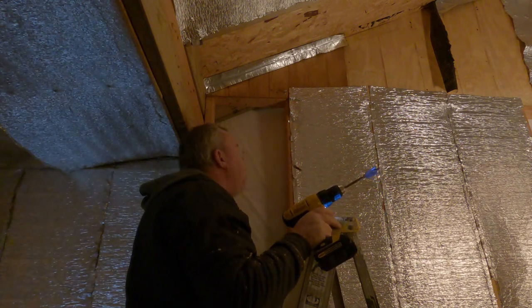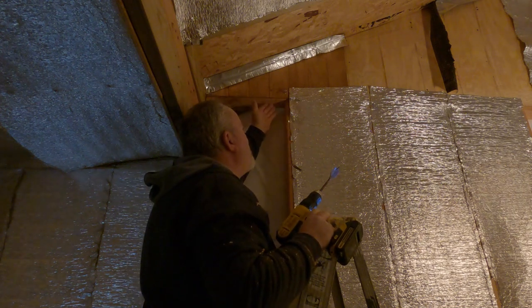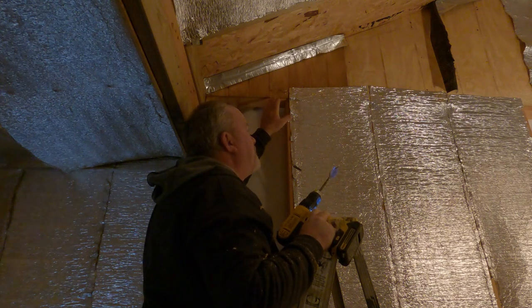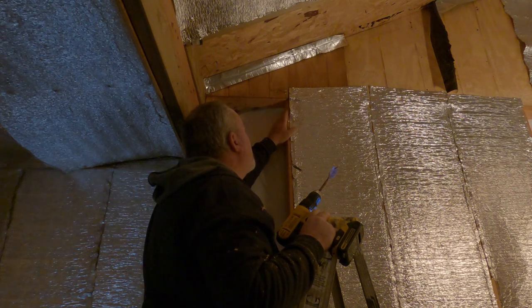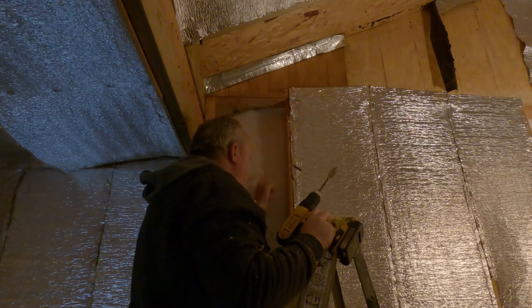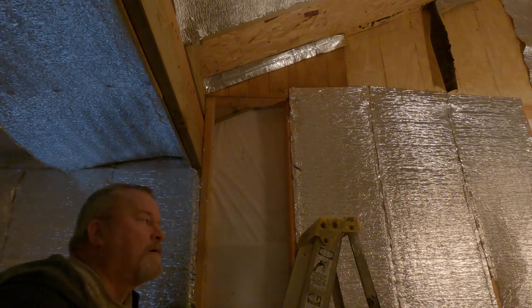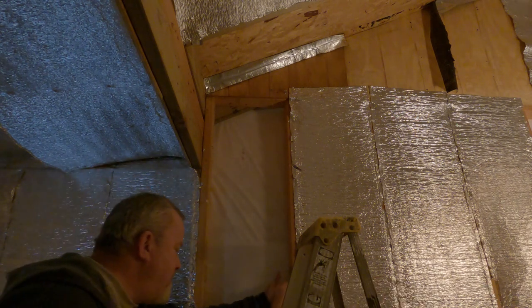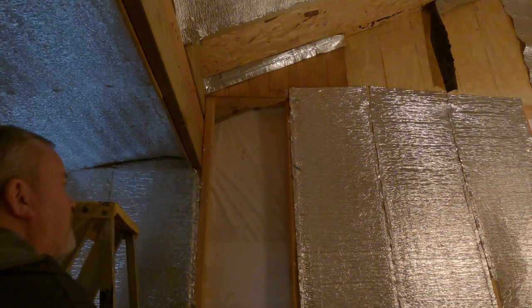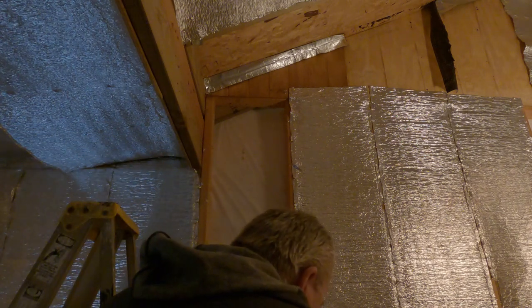That couldn't be any better. You'll see, this is kind of a weird structure. On the outside is where I'm going to have to insulate on this. I don't remember why I did that. I think it was because I could not get up there somehow. But this is all going to be covered anyway. So now I want to come in from the outside, run my wire down to this outlet, and then go in series all the way across. We'll just come straight down, attach it to this. So I need to go out there now and get in that little cubby hole and feed that roll of wire through there. I'm making a hellacious mess.